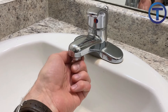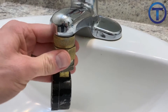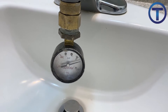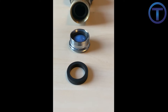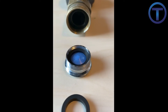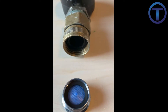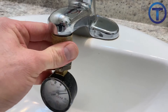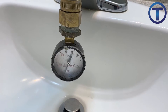If you're struggling to find a hose connection, you can also connect a gauge to a faucet by removing the aerator and threading the gauge into the faucet using a special adapter. The adapter has the option to thread into a female or male thread on the faucet aerator location, and the male hose threads on the other side connect to the gauge. This is a quick and easy way to check pressure, but some aerators are difficult to remove or don't have the same thread size, so don't try to force it.